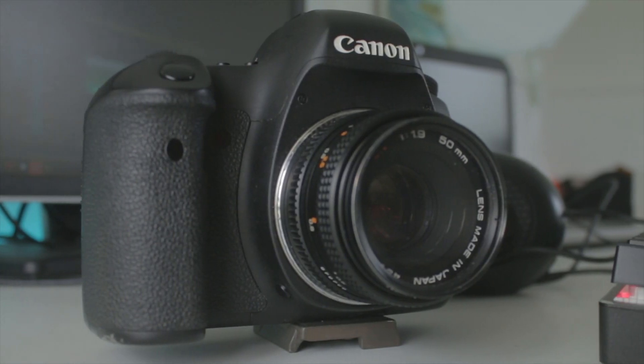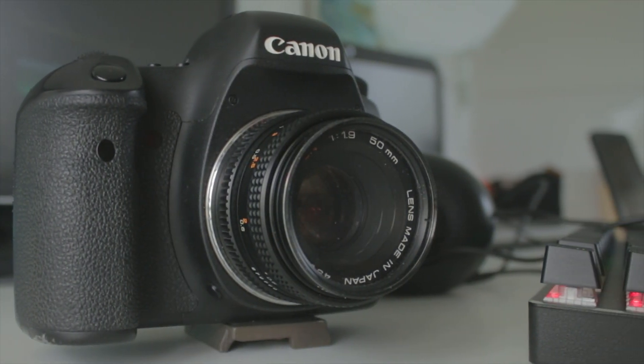For the video department, as you can see it does look really good. The lighting I'm using is just a window, which is why it doesn't look the greatest, but I wanted to show a very budget-oriented setup and window light is what most people use for webcam setups. The advantage of a full-frame camera is a lot more background blur — the background behind me is completely blurred out — and I'm using a $10 50mm f1.9 vintage lens from an op shop. There's no autofocus, but if you set the focus and stay in the same position it's fine.